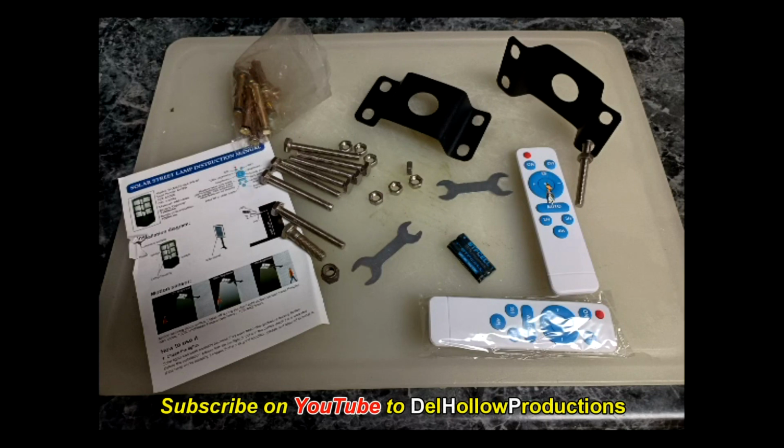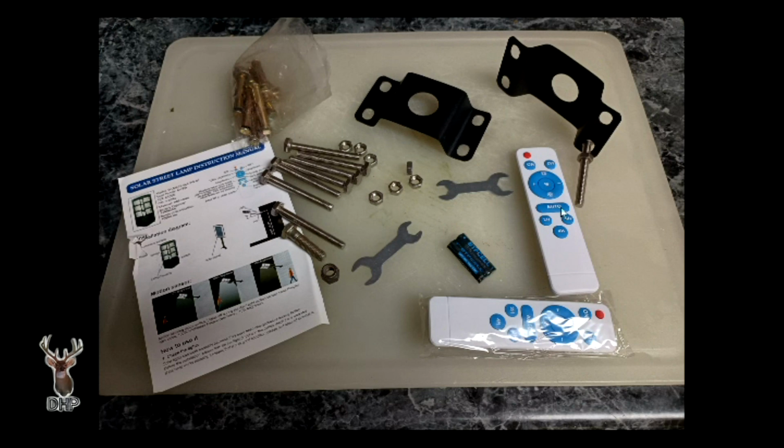We do sort of have over here a manual mode and auto mode. You can do 2 hours and then go into a dusk to dawn mode, or you can do 4 hours or 3 hours full bright before you go into reduced power mode in that motion detector only. You can go manual and go obviously up or down, and then full bright, full minimum here, off and on. The device has to be turned on. The actual luminaire has to be turned on before these buttons will respond.